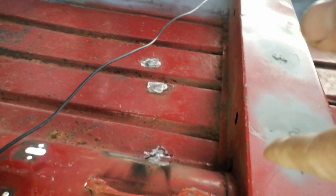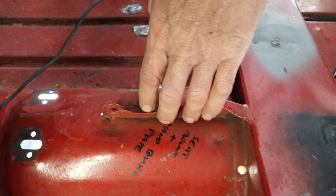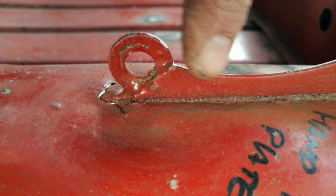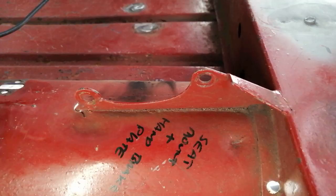There's actually nothing wrong with the bracket — it's the floor that it's mounted to that gets the pounding. So I'm going to straighten this out and put a reinforcement plate across the top to distribute the load. Someone's welded a washer onto the end because this bit has snapped off, and it's cracked the floor as well. That's answered that question — upgrade time.